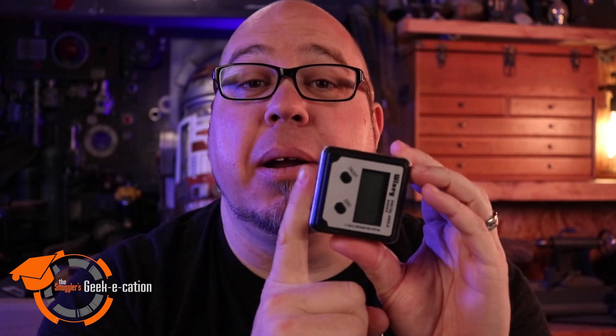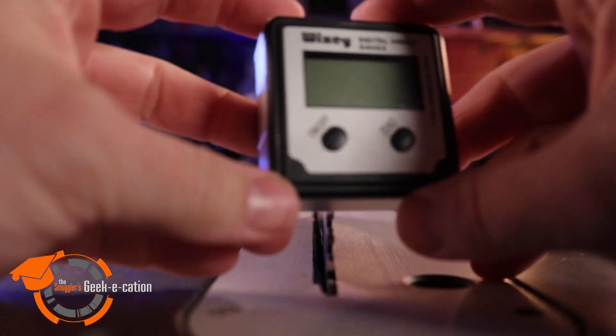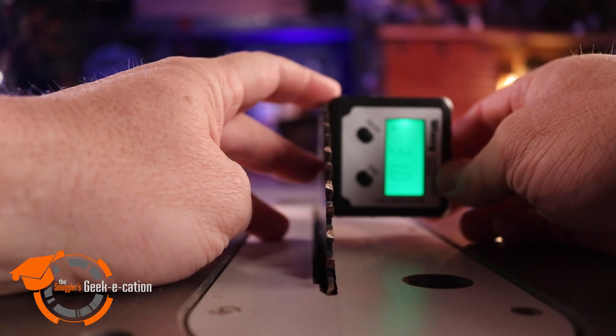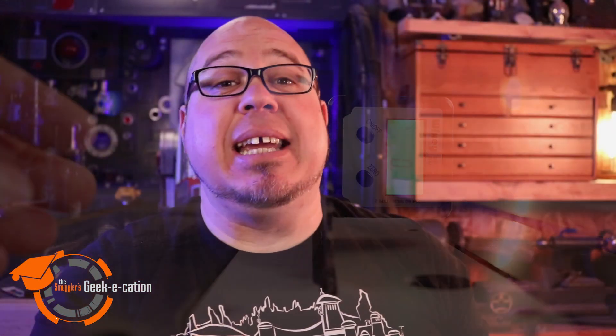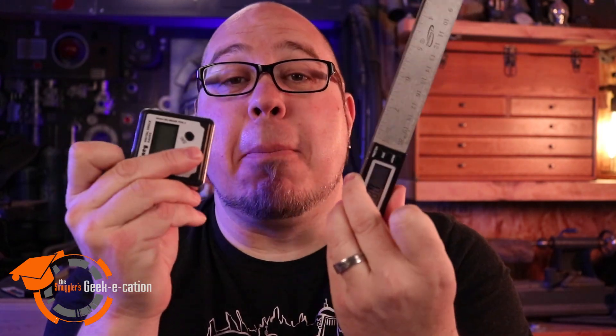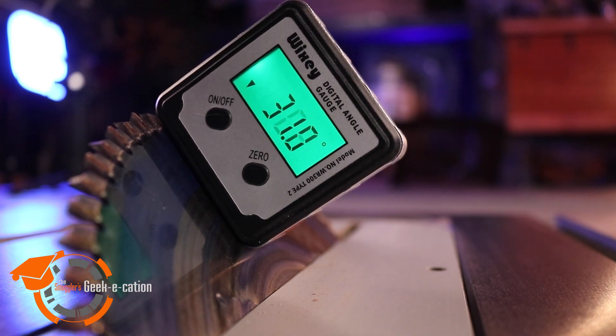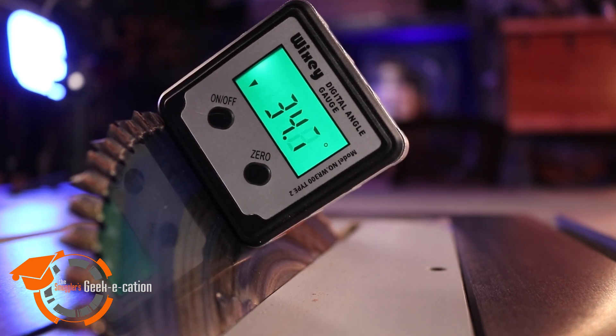The last in this list of digital family items is a digital angle gauge, and this has a very specific use case for me. It's magnetic on the bottom, and I can set this against the saw blade on the table saw and rotate it to get the exact readout of the degree of angle I need. For example, I can take the digital protractor and the angle gauge together — if on the protractor I set it to 34.5 degrees, I can then put the magnetic digital angle finder right on the blade and rotate that blade to the exact measurement I'm looking for.